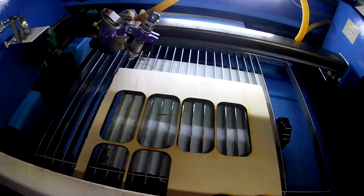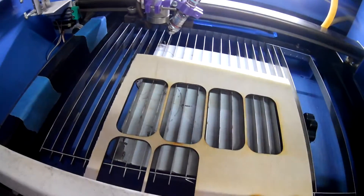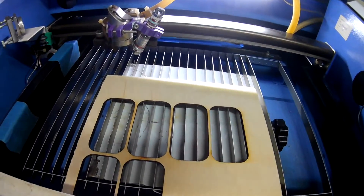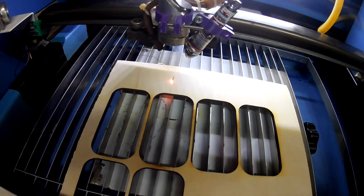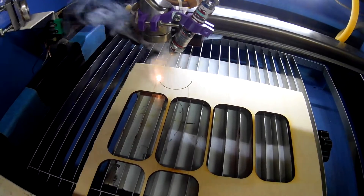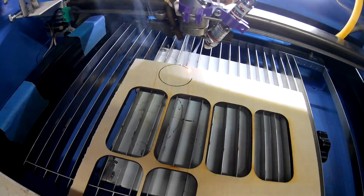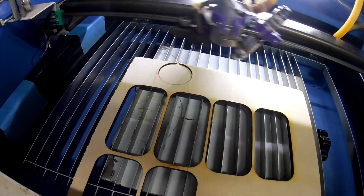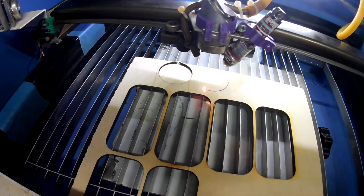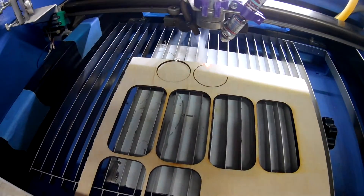Let me get something going — I'll just cut a couple of circles so you can see. I'm going to keep my air assist on, just for noise. This is three millimeter birch plywood cutting. Obviously there's already glue in here and all that, but if I was laying this flat down on something there'd be nasty stuff all over the back of it. I'm cutting at about eight milliamps at seven millimeters a second.